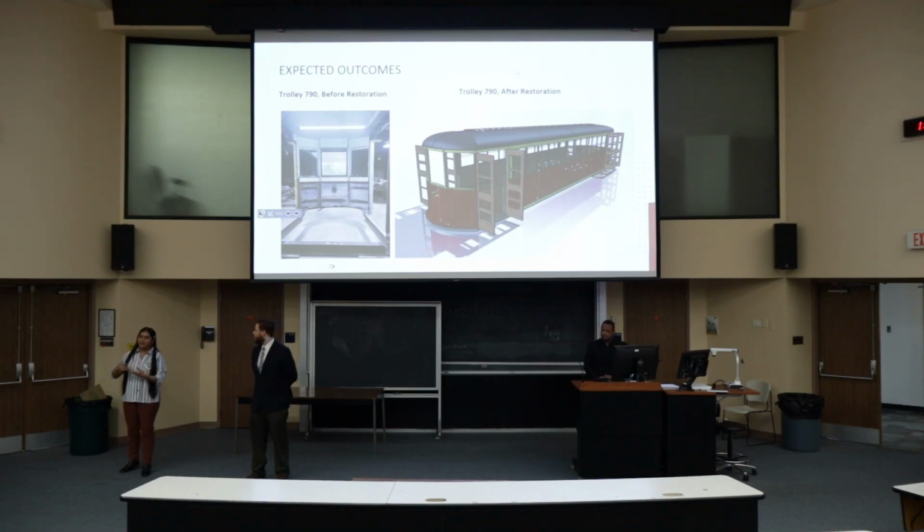Yes, right, because it was a list of the components, and in that list there were the different controllers with the E241 models. But as I understand it, you didn't know at the time I talked to you that these were DC motors. They could have been AC motors. That was unclear, and maybe they're series wound motors that will go with either AC or DC. That's what I assume was in the original trolley. It ran off 600 volts DC, and those K35 controllers seem to be built for that kind of motor. So I think there are some questions about the motors that have to be resolved before you know what you're doing with that.